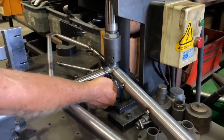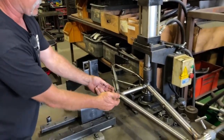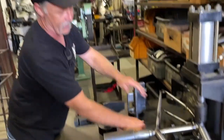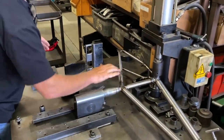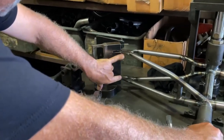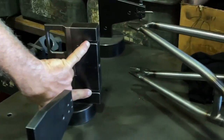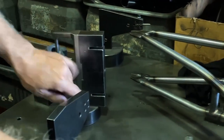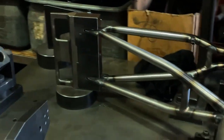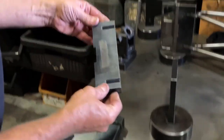If we had a narrower bottom bracket, we'd have a taller spacer block. This keeps the center line of the frame perfectly in line with the center line of this tube, which is also interchangeable for 25.4 or 27.2. Now in the back, if that wasn't straight, that wouldn't go in. So you know that's good too. The whole thing's perfectly parallel. To check that the dropouts are where they're supposed to be — the correct width — you've got to get the right spacer block. I've got a 112 millimeter ID inside measurement, and then I've got the correct tool for this thickness of dropout. If we had the quarter inch dropout, I would use this 112 block with the wider slots.